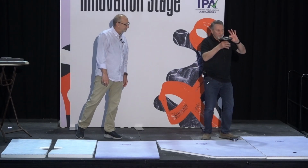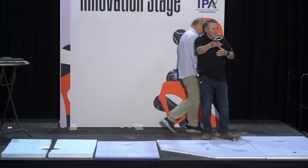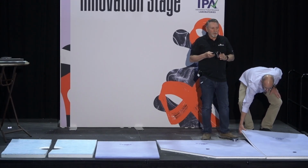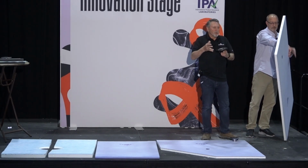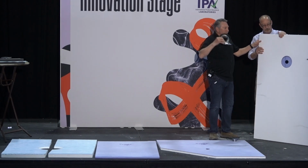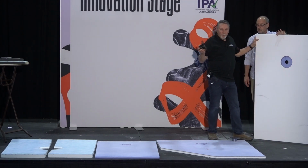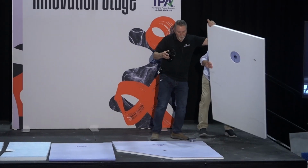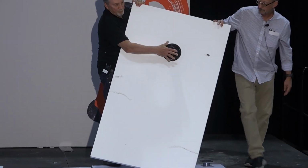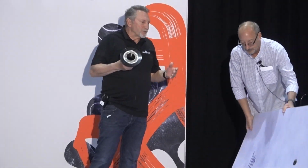It's 1/2 inch tall, so you're going to directly screw this down to the substrate. You can give it to the plumber, tell him where you need it, and he can screw it down to the substrate. Unlike some other ones where the drain has to be put into their base after the base is in. With this drain, our base has a 1/2 inch thick area where the drain will sit. So the drain is installed first into the substrate, by either the plumber or yourself, with a standard 2-inch connection. So the plumber can take responsibility for that connection.